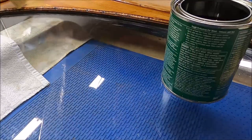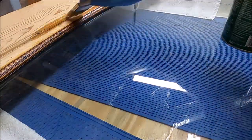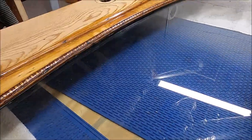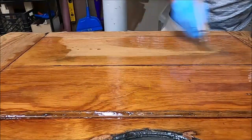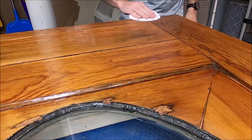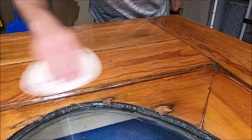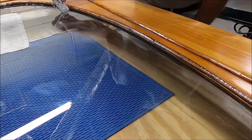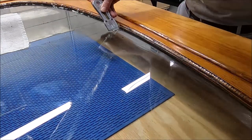I went in all the little nooks and crannies first and then got coverage, then took long brush strokes all the way down so I wouldn't have any overlap. The video portions of staining and seeing this kind of stuff is satisfying — it just really makes all the grain pop in this wood. I'm glad I spent the extra time on sanding and using the card scraper. Up close you can see the wood filler certainly is not ideal, but if this was a new project I would have needed to spend a good bit more time making that prettier. Once you see it from a distance it's not that bad — it's character.